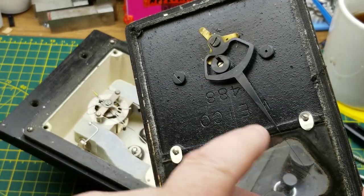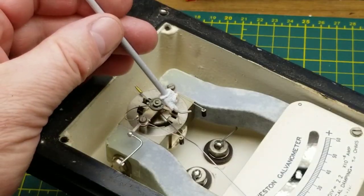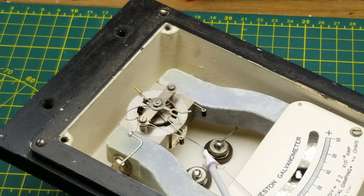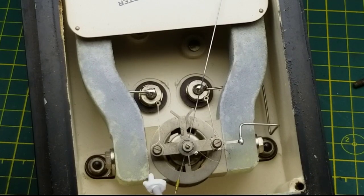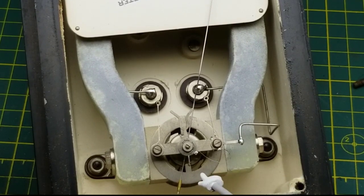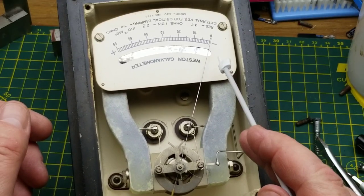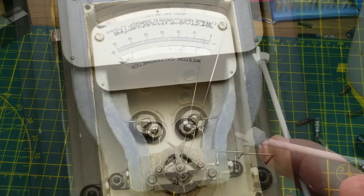The limit needle is permanently up there. There is the back of the zero adjustment screw — it has a little offset peg that goes down into a small fork, so when putting it back I can slide it in. Very much like the diagram on Wikipedia, there is one permanent magnet here and the other there. Here is our needle with a little counterweight on the back, held in a bearing. When you adjust the screw it moves the whole mechanism. Without the metal front cover, the magnetic characteristics are slightly changed and any stray magnetism in the room affects it.